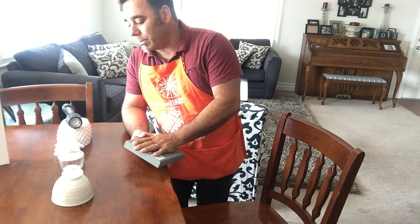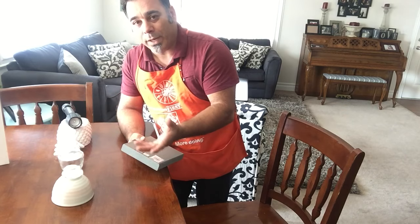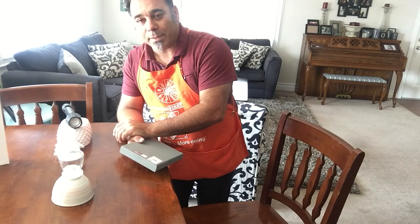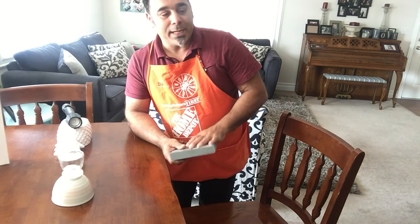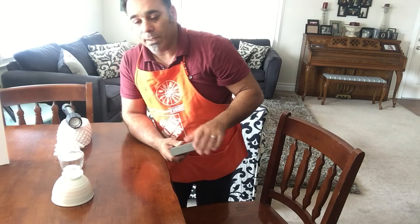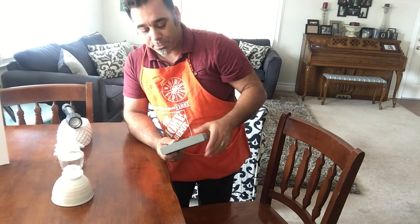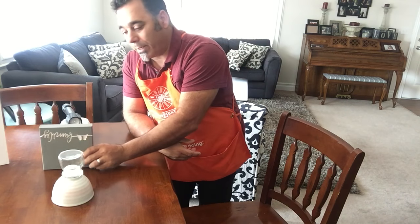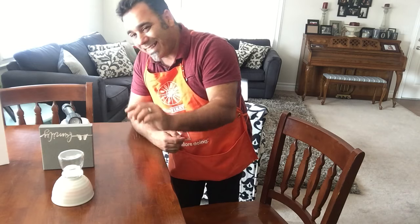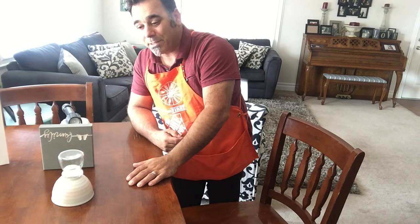With technology, windows have improved. The single pane kept out some of the elements — the wind, the rain — and possibly some of the UV rays. So let me put up what's next, which would actually be a double strength glass — like one of the panes of what's in the Simonton 6500. That was actually the next technology introduced to the window industry. With the double strength glass in front of the heat lamp, the radiometer is still spinning. It might have slowed down a tiny bit, but it's still moving pretty fast.